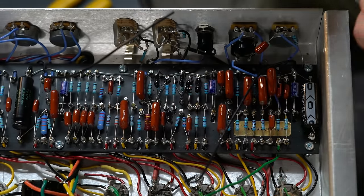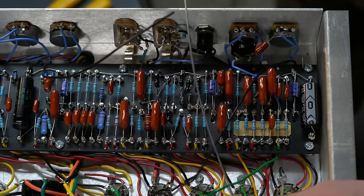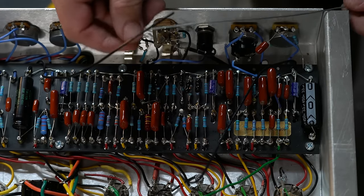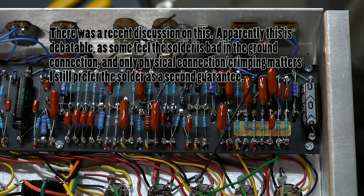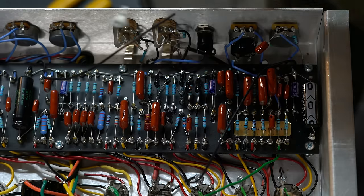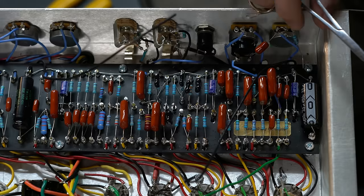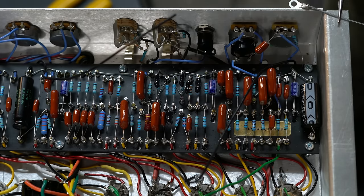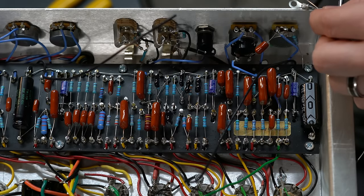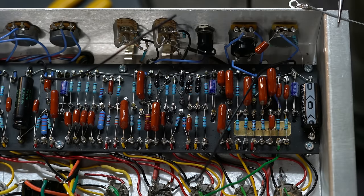Now I have a physical connection, but I also like to follow that up with some solder as well to keep it from coming loose. I've got a hemostat type clamp here — for amp building that is very invaluable to have around because you can clamp things down very easily. I'll get my solder and iron and touch that up so it locks it mechanically as well. There we are, I'll let that cool down.